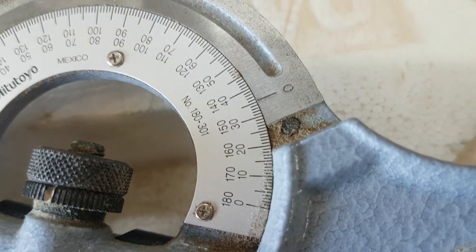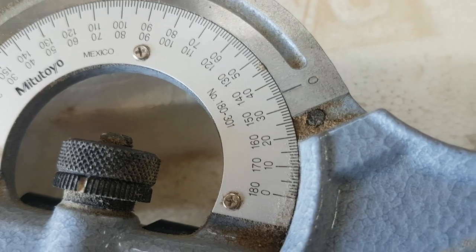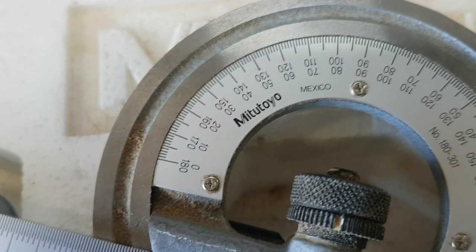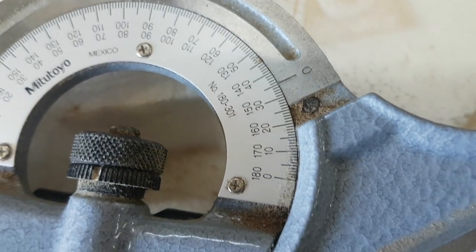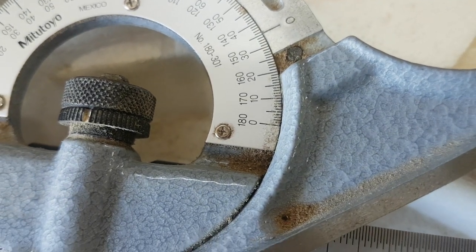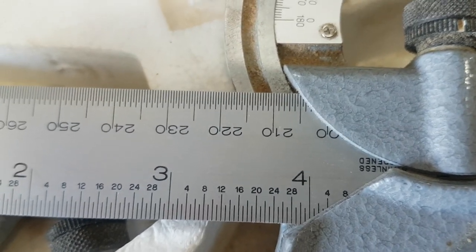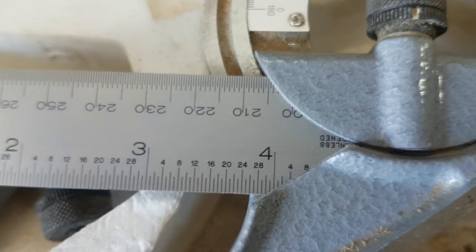Now the protractor scale is degree increments. That's really not quite fine enough for most jobs, and certainly not for these mitres. So they look very fine, but the scale is actually pretty close to useless. The whole field of viewing width here is about 3 inches, or 75 millimetres.